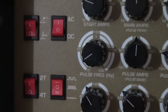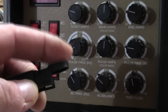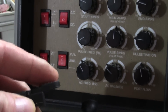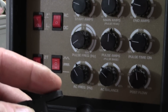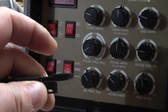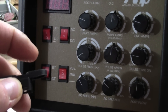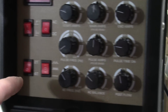People sometimes have questions about 2T/4T. It just refers to the number of trigger actuations needed to complete a welding cycle — start through termination of the arc. In 2T mode: press the trigger and the arc starts; do your weld; release the trigger and the arc terminates. That's two actuations — two movements to complete the welding arc.